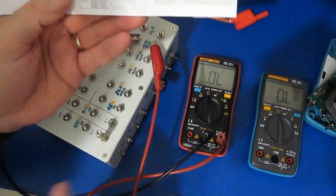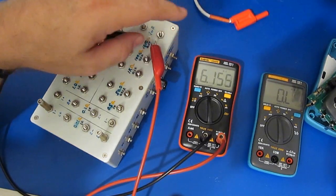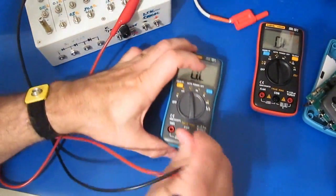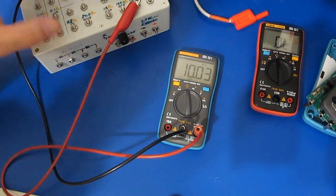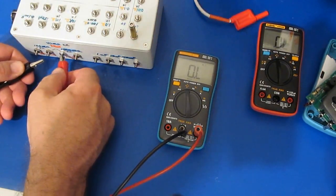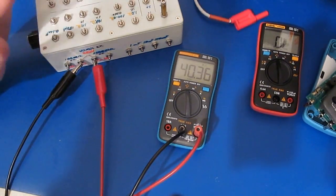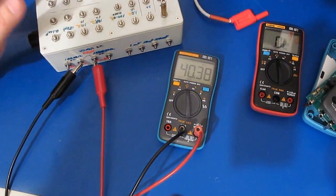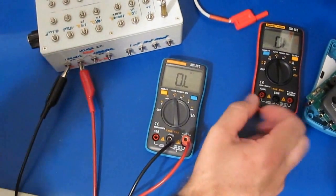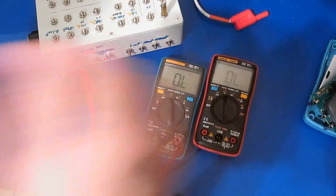That's the top end of it. I mean, this is right at 10 meg. Right there. Huh. Let's have a look at the 8002. I thought for sure this could read this without any problem. There you have it. 10 meg. This is with a 40 mega ohm resistor. This is a 2% part that's on here. And let's just try her with 100 meg. Can't go up that high, but 40 meg. So if you're needing something to go above 10 meg, again, this 8002 definitely outperforming the 8008.